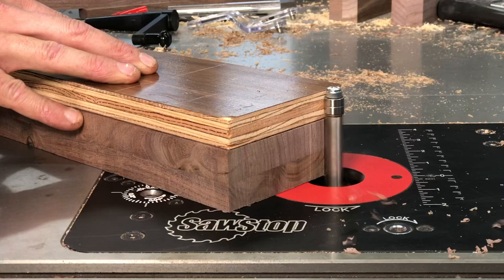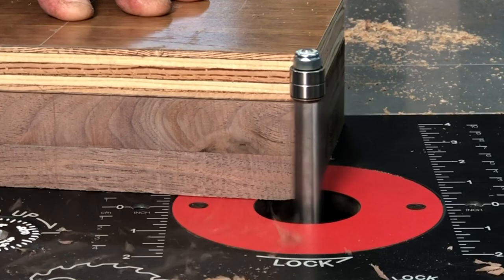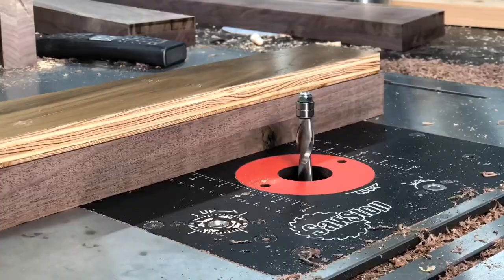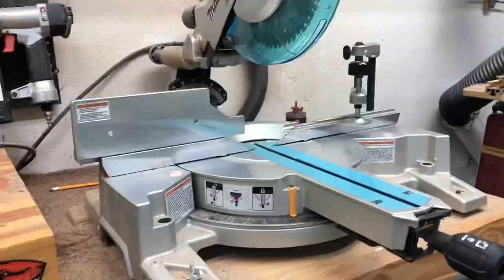If you've never used a template to build furniture before, it's a really cool, remarkably easy way because you don't have to worry about getting the same consistent cuts. If you set your angles on your miter saw and it's just off by half a degree, if you use your template, it's always going to be exactly the same. Since I was going to have essentially four leg pieces made out of this template, all of them were going to be the exact same angles — everything perfectly consistent using that template and that router bit.